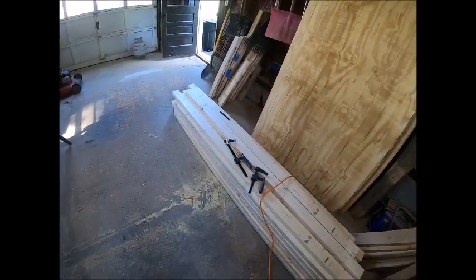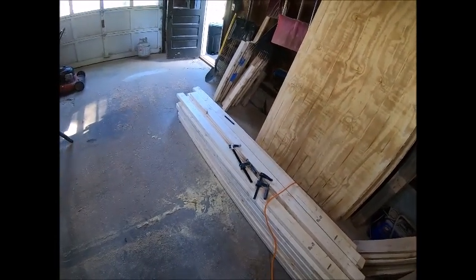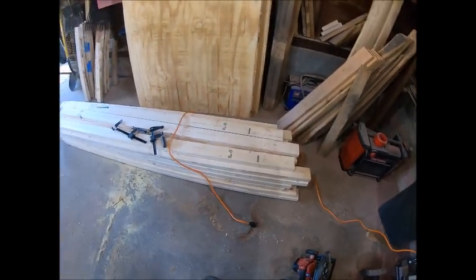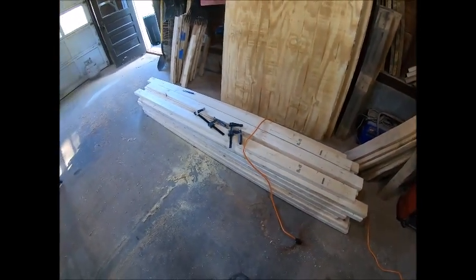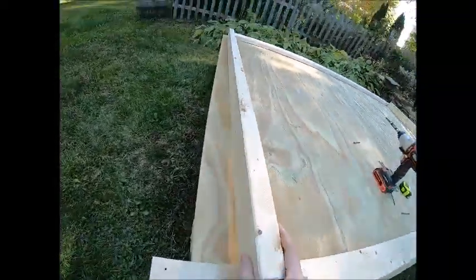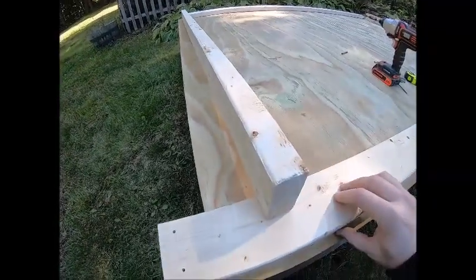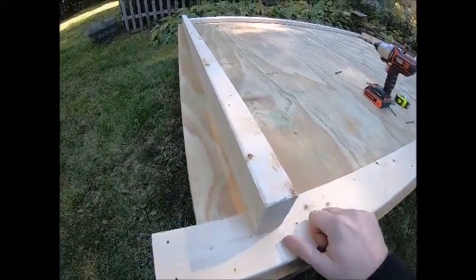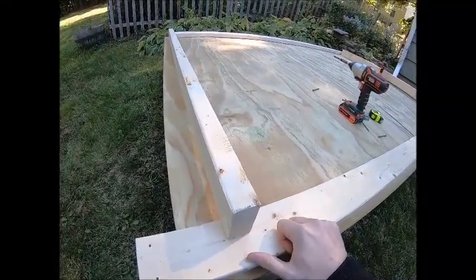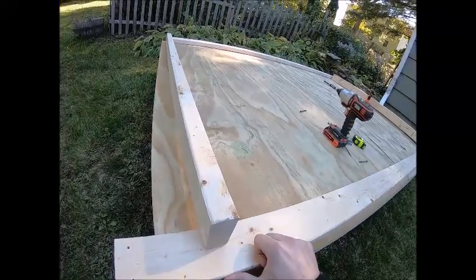So I'll probably go ahead and just do that. Then I can at least get it screwed together and set aside for whenever the inspector comes out here. So I'll probably start cutting these. All right, so I decided on cutting them all to 65 inches, which will, combined with the 1.5 from each of the top beams, make it about 5'8". That should be fine for the back wall, and then the front wall I'll do 7'6".